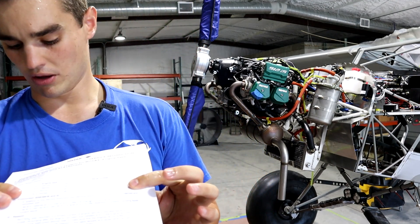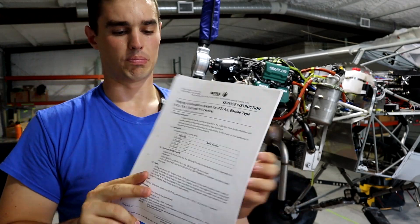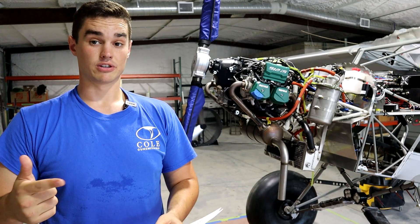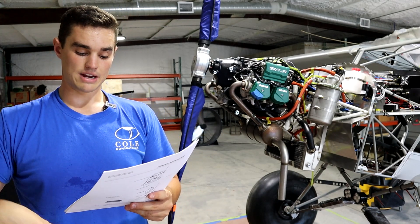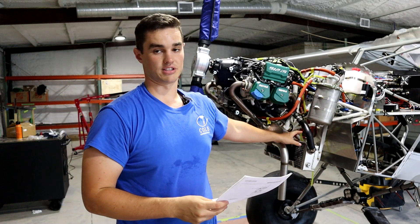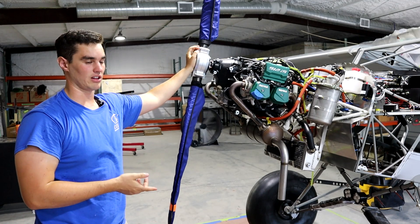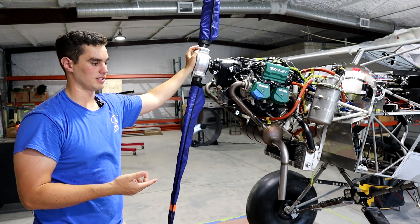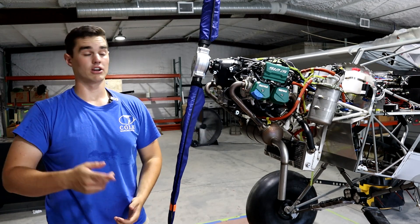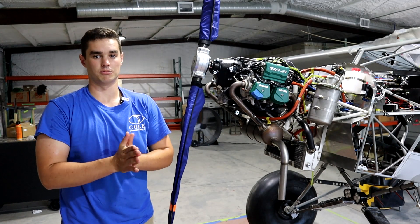That was service instruction 912I004R1 for the 912IS - good for all the Rotax series for purging the lubrication system. This needs to be done before you run your engine for the first time, after you reinstall the engine or overhaul, anytime you drain the oil system for maintenance work or pull the oil pump off, and anytime the actual oil system is disconnected. I'm not starting this engine until I go through that installation class in Sebring - I'll put a link up to Lockwood's website. Maybe in two weeks I'll have a video out on the engine start, which I'm pretty excited about. Hopefully this is helpful - I couldn't find anything on the Rotax 9 series for purging the system, so hopefully this is useful for other people to learn from. See you next time.